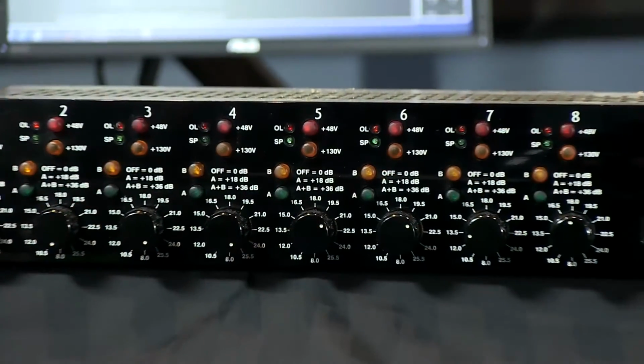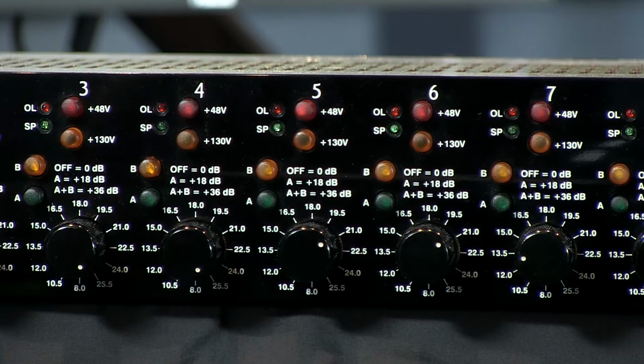What you just heard was a DW drum kit with an Audix Studio Elite drum pack going straight into the Millennia mic preamp. The Millennia mic pre is a serious, accurate, super wide dynamic preamplifier intended for very demanding acoustic recordings. It combines precisely matched discrete bipolar transistors with a laser-trimmed DC-coupled FET-based output driver stage. Unlike most mic preamplifiers, the HV3D never unbalances and then rebalances the original signal, thus maintaining the highest degree of signal integrity. It is a transformerless design and has pure timbral accuracy.